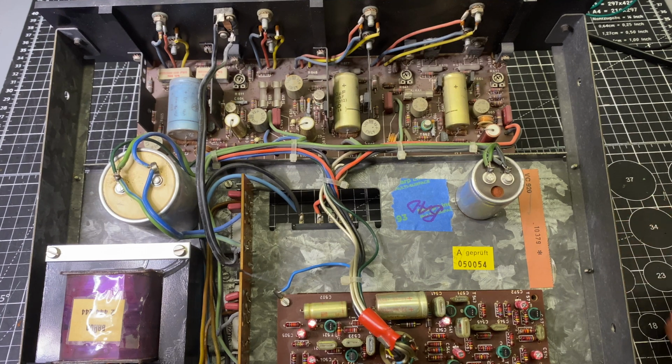And another bonus is when you have a designer like Braun that is building an amplifier specifically for the speaker that they're building, I'm sure the engineers took time to make sure that everything was matched up exactly how it should be. If you're designing your own system from scratch, picking out an amplifier, picking out a speaker, sometimes you'll get really lucky and find a really good match, an amplifier that's a perfect match for a specific speaker, and it just really performs well. But if you bought a highly inefficient speaker and then decided to buy a single-ended triode tube amplifier, you might be in a world of hurt. So a design like this takes care of everything because it's all built in one neat package. And I'm excited to see how this thing performs when it's all done.